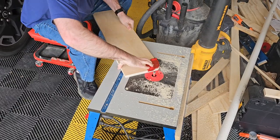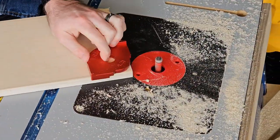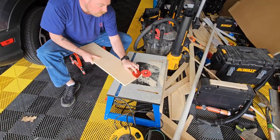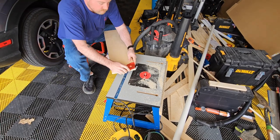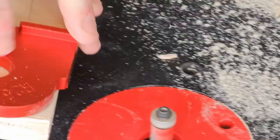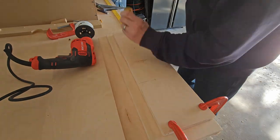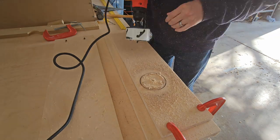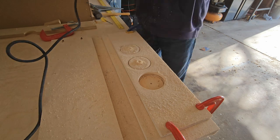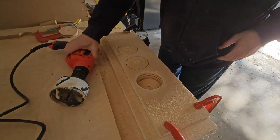I ended up contacting a friend who had jigs for making rounded edges. After talking it over with him, we decided that the 25 guide was best and gave us a half inch rounded edge — this was exactly what I was looking for. Next I added three three-inch holes to the bottom panel. This is where airflow will come in from the top and be pulled down through the cabinet and out the back, and it also allows cables to be routed from the cabinet to the back box.